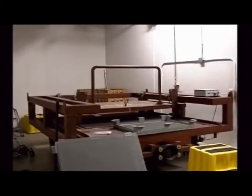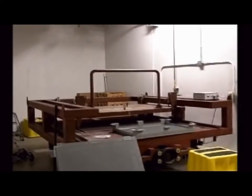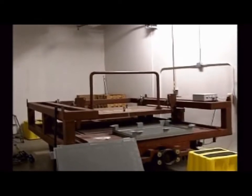But this level is the vehicle transfer level. Whenever we have to swap a vehicle out, or we have a vehicle over here we call the pig, that simulates a cab weight, either an empty cab or a weighted cab, depending on the configuration. They have to transfer it by hand. The vehicles weigh almost 3,000 pounds. They have to push them out by hand, jack it up, turn the casters, then slide it out of the way, bring this pig, or another vehicle they're going to swap it out with, slide it into position and then push it in. That's all done manually.